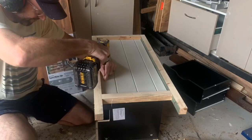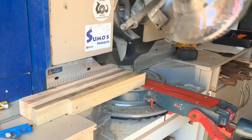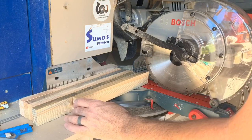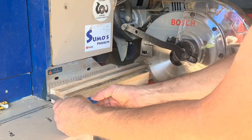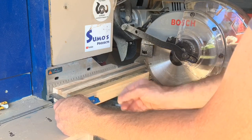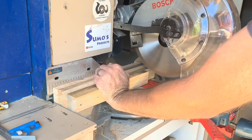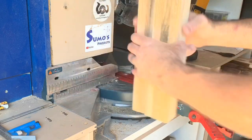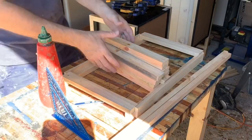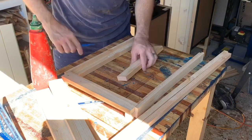Moving on. I'm throwing a bit of cladding inside which matches the walls of this place - it's pretty cool stuff. I've got to cut a heap of repeatable cuts for this shelf, so here's a little quick tip: line the front piece up with the tip of your blade and slide all the other bits in behind the blade. You need a sliding mitre saw obviously. Square it off, cut it, boom, done. Then we can glue it into position.